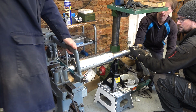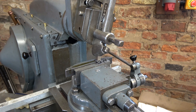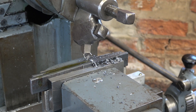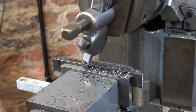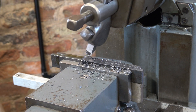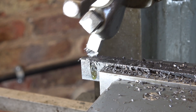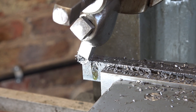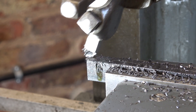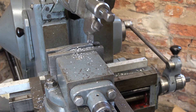Jammed. Okay, this isn't going to work. Well, we shouldn't have tried that really - just being lazy. It didn't break the blade, it just jammed. Well, it's a good job we're not in a rush. We'll probably do this in two minutes on the mill once it's set up. Thinking about it, it would be a lot more efficient to cut it lengthways. But I always like to cut against one of the fixed jaws of the vise rather than in a position where the work could slide out of the side. I cut the angled bits with the hacksaw so I'm just smartening them up now.